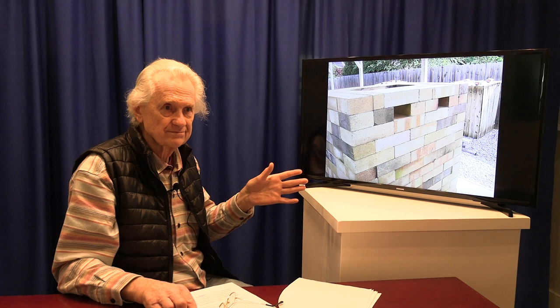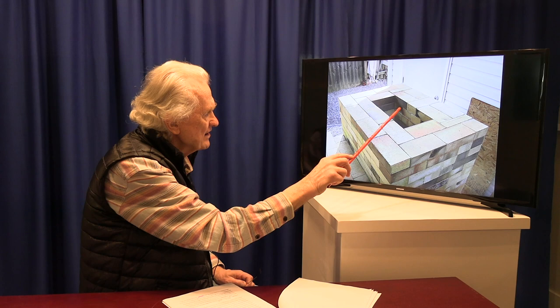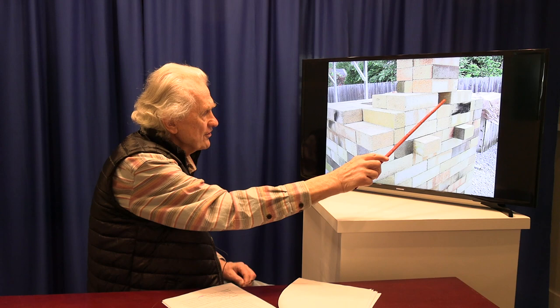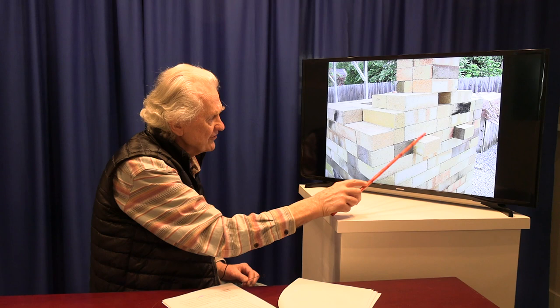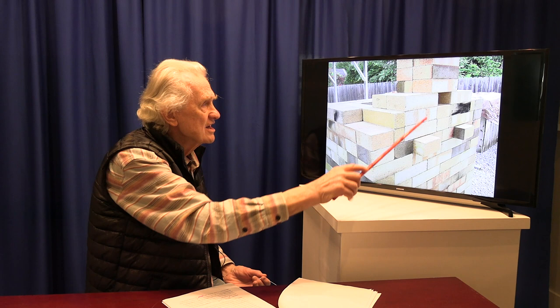This is a top view looking down at the chimney flue - you can see the two passive damper openings. We decided to add a third passive damper opening. Here are the two lower ones and the third above them. We always use a three-brick lintel over these openings to support the weight. This is especially important for an opening with a removable plug - if it were to crack and sag, we wouldn't be able to remove or reinsert the brick.